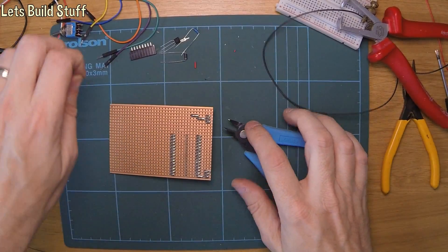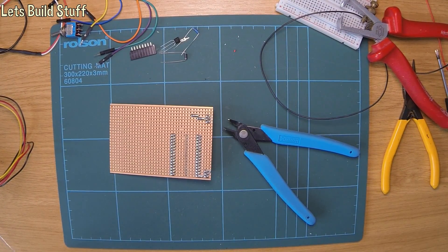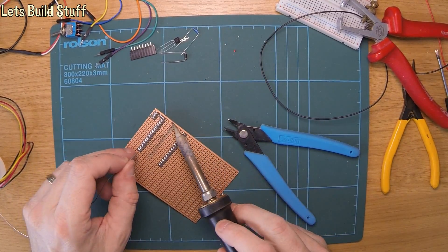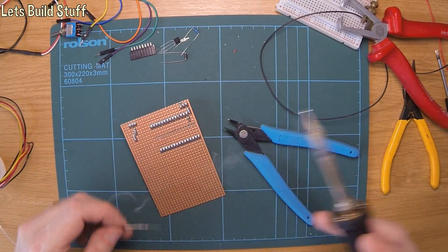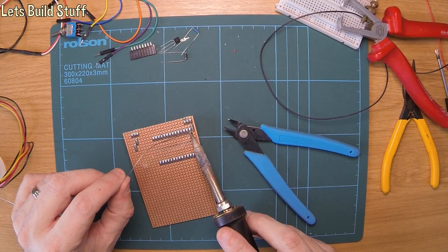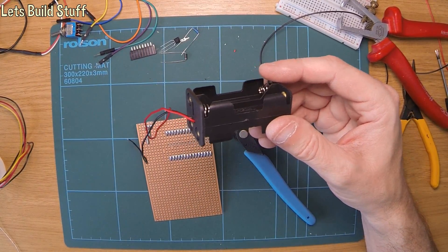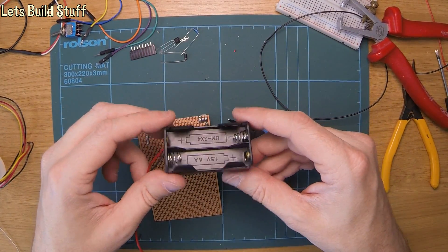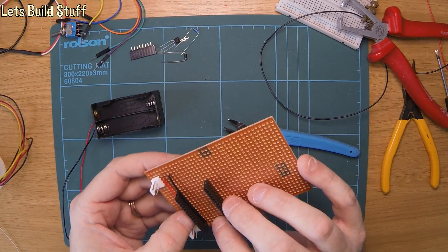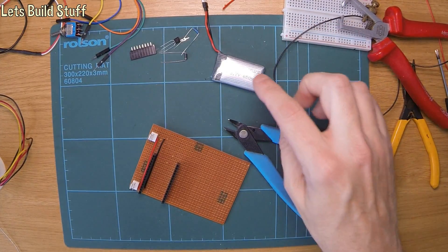It's actually a five volt relay but the battery's 3.7 volts - it does seem to work on that, I did try it and it certainly did switch on and off quite well. When the voltage drops much lower as the lipo starts running out, it'll probably stop working. But if it does, I have actually got another battery type - it's got four 1.5V cells so it'll give you six volts, but then I'd have to use a voltage regulator to drop that down to 3.3V. It seems to work with the 3.7 volt single cell lipo for now.